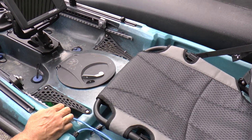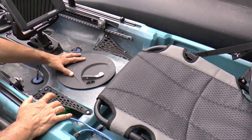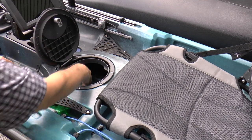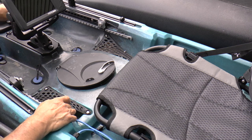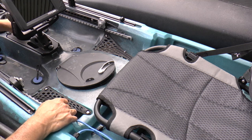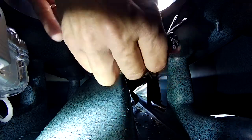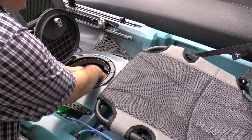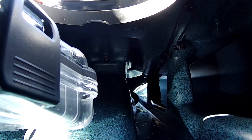From the front of the kayak, there is a 10-gauge wire that comes down the left-hand side to a waterproof box that houses the PWM controller, which sits right in this area. The PWM controller box has a bungee from the back that wraps forward around this forward scupper that goes through the inside of the boat. That scupper gives a post on the inside, and I have a bungee wrapped around that post with a hook that attaches to a loop on this box. If I need to remove this box, I can unhook the hook and take out the waterproof box.